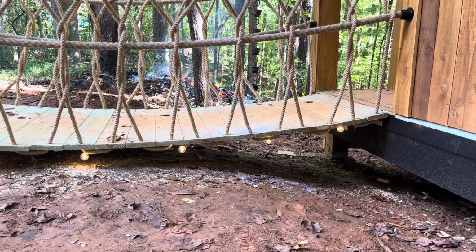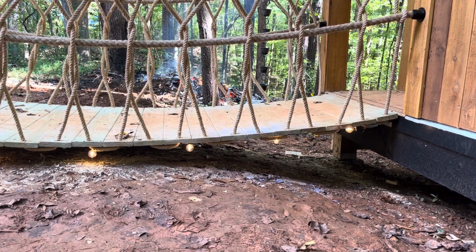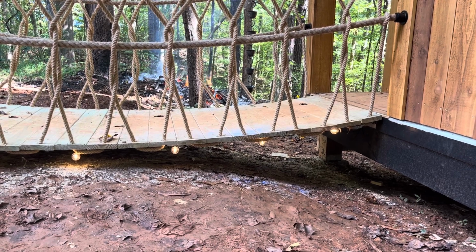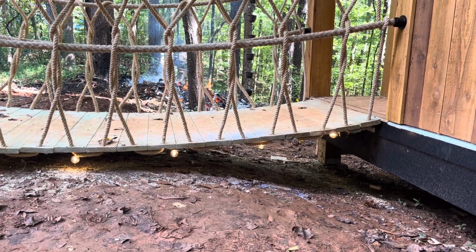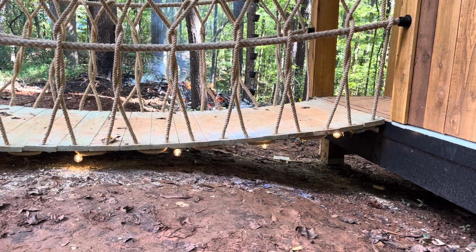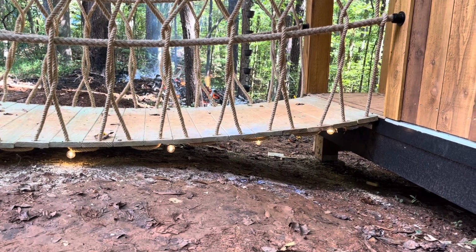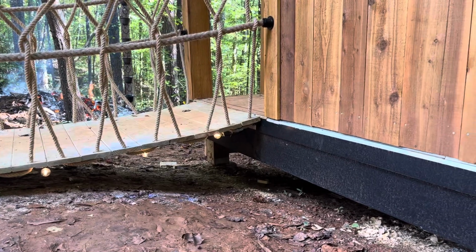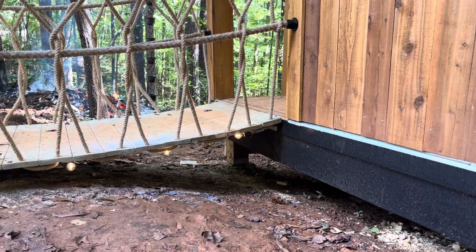That was done by extending the eye bolt that goes through the structure, leaving it loose, making up your cables as they do with the kits that come from Home Depot and Lowe's, etc., and then just start cranking down on the nut on the back side of the joist, and that'll just get your cables tight. There's no need for turnbuckles or anything like that.